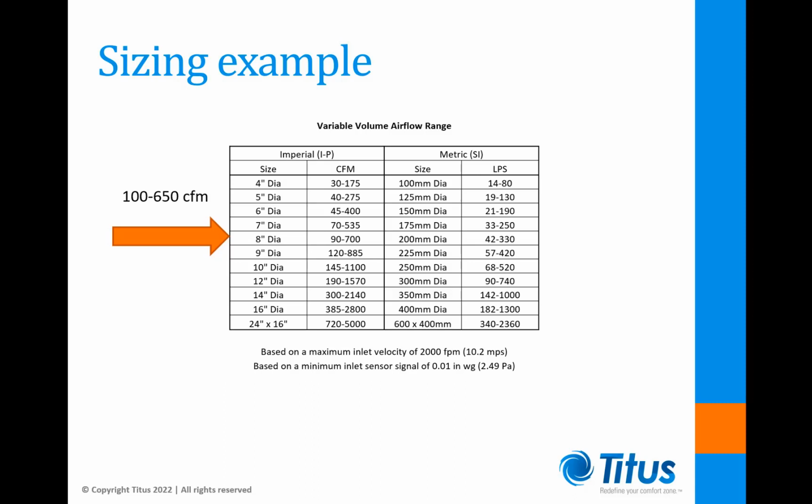very easy choice. This selection provides a low pressure drop, low sound levels, and excellent controllability with an 85% turndown.